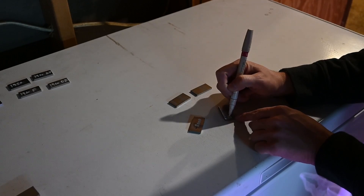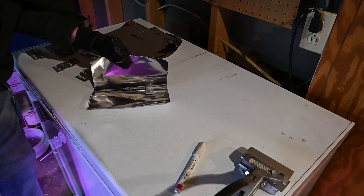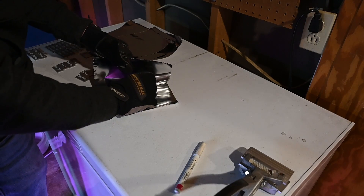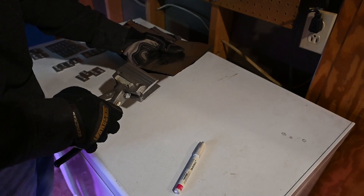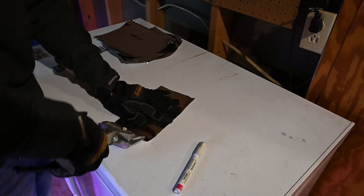First, I cut out the coupons and labeled them with a white paint marker. The white paint turns black when heat treating in foil, so you can maintain the labels. Wrapping the steel in stainless heat treating foil helps to prevent scale formation and loss of carbon, called decarburization.